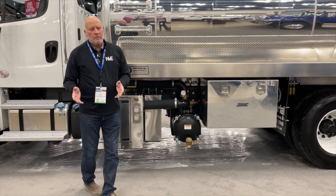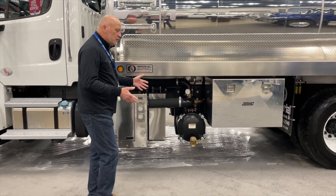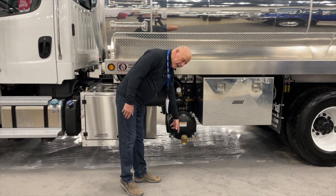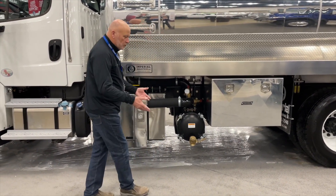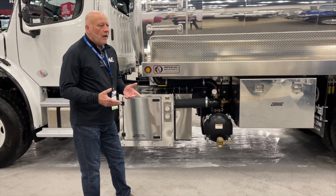Since we're at the end of the day, we're going to drain our moisture trap. The diesel is now in the moisture trap as well, so we're going to get a bucket and drain it. You can just leave the bucket under the moisture trap secondary for the night.